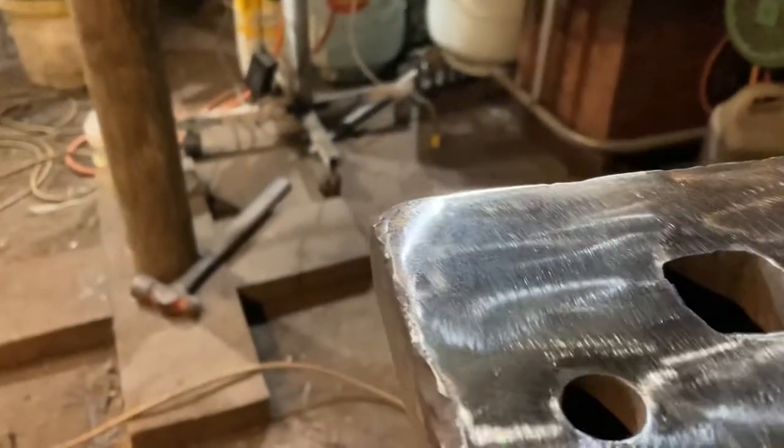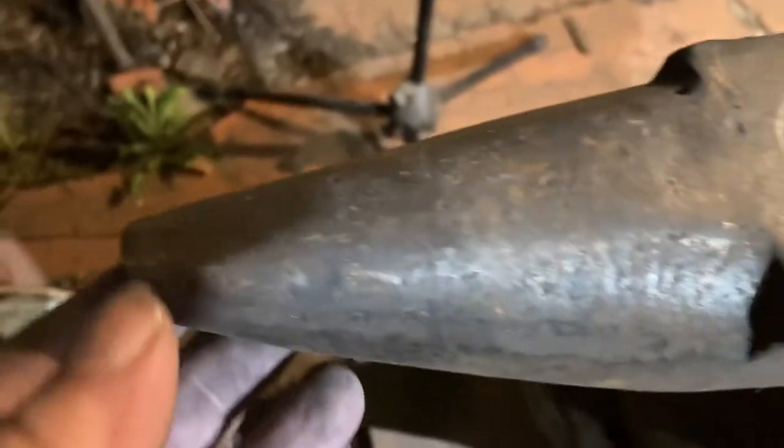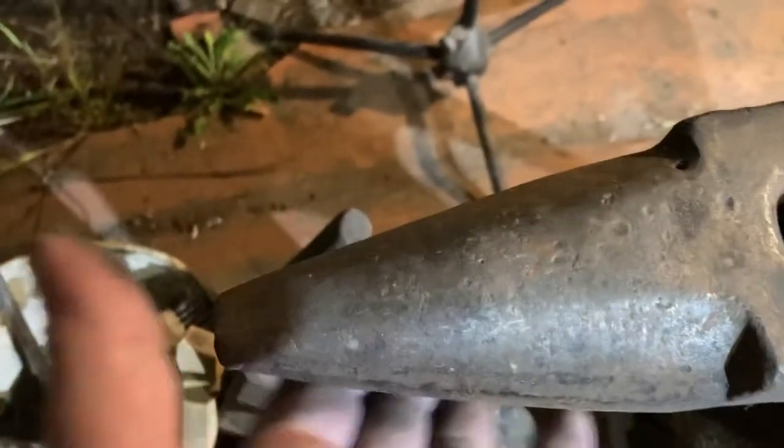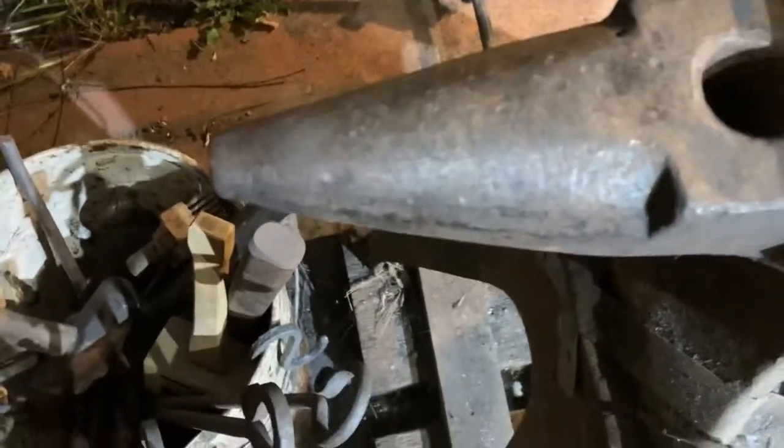You can see how just after a couple of minutes it brings it up a lot better - absolutely magnificent. Now while I've got this one on there, I'm going to clean up the edges. They've sharpened up a bit in places that I don't want them sharp, so I'm just going to put a little bit of round-over on them. There's a nick here that I'm never going to get out, and there are some other nicks too, but I can soften everything up a bit. Also while I've got it on, I'll do a bit of work on the horn. The horn's a little rough - it's supposed to have a slight flat coming out of here, but I want to ease that back a little and just go over the horn to get a lot of the big dings out of it.